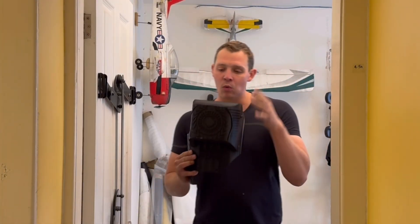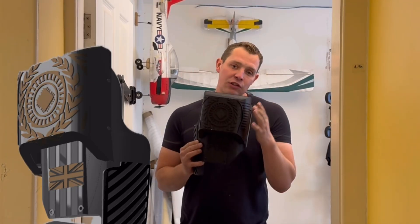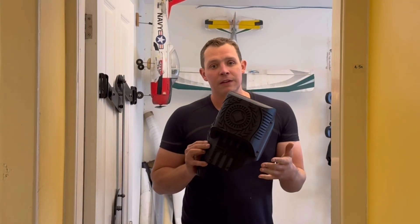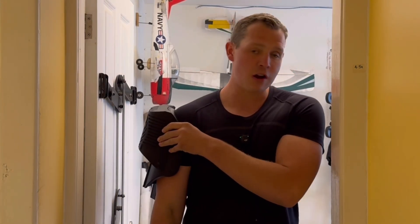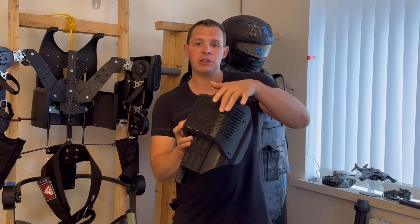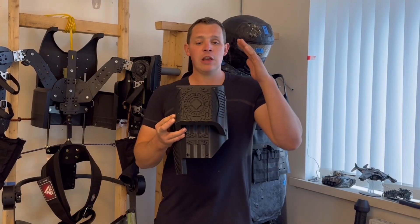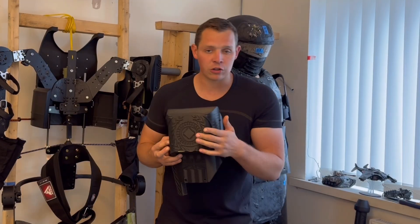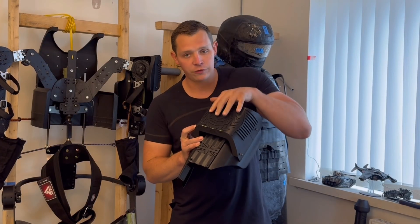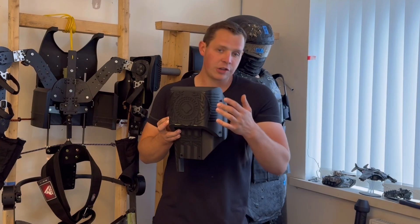When I first did this design I wanted to make it interesting, so I put a nice pattern on the cover that goes over the actuator. But what I've realised is that with how it sticks out it's just going to get scraped off. While I've been making this suit as narrow as possible to fit through doorways, it's still going to stick out and get scraped. So it would actually be beneficial to use these covers like cat's whiskers in narrow corridors — being able to scrape down the sides without damaging the surface. I want to build the new covers with attachment points so I can attach sheets of nylon or similar as sacrificial parts, so you can scrape down things without any problems.